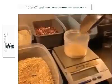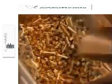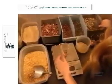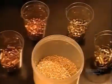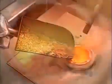Bright yellow, so it's common to create an alloy to strengthen it and alter its color. Copper lends a reddish hue, and brass helps the alloy melt more quickly than gold and copper would alone. Depending on the ratio, adding these metals produces 14 or 18 karat gold. They melt the mix in a crucible at 1010 degrees Celsius.